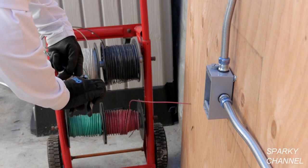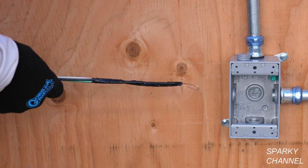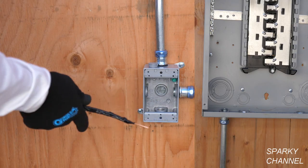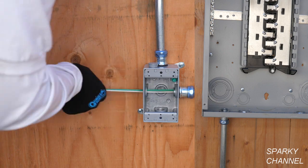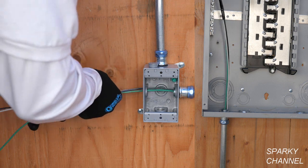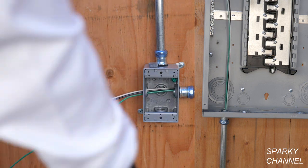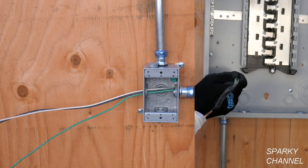Then I'll make a bend in the stripped wire and press it down to make a loop. This is what it looks like now. I'll put the wrapped wires in the opposite side hole and into the conduit that goes to the load center. Then I'll run the wires by hand through the conduit until it pops up in the load center. Fishing the seven feet of wire took six seconds.